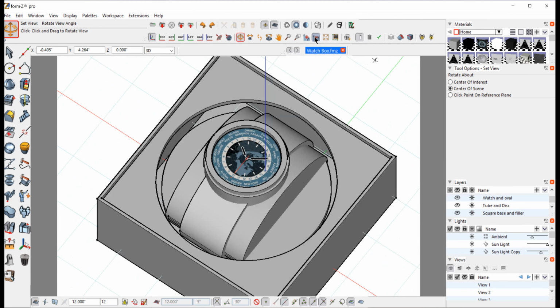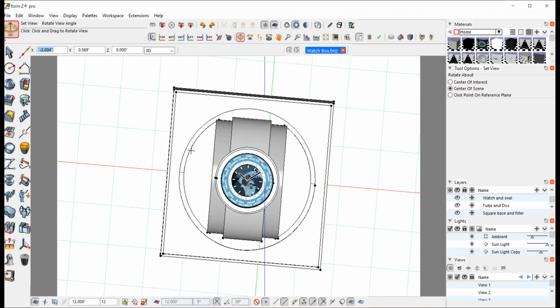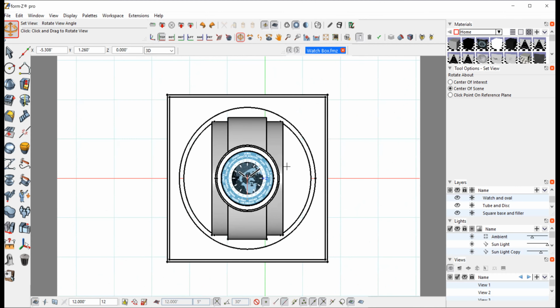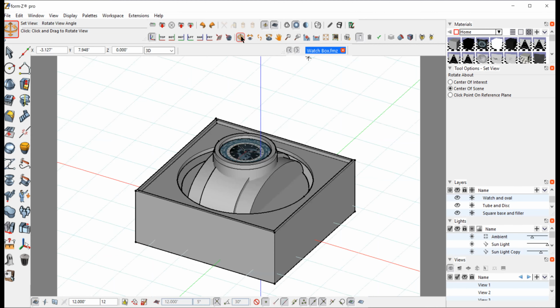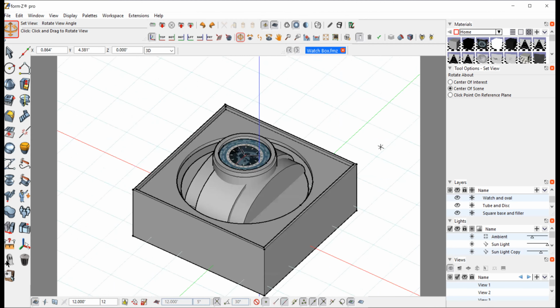This is the same process that we're going to use here for this workflow. So I knew from my sketch I wanted the proportions of this box to be square. So I just decided to make a square shape, this proportion, which gives me enough clearance around the parts so I can have that circle in there. I'm going to build a filler in here that's going to support that. And I can look at my dimensions. So, a little over 4 inches by 4 inches, which is a nice size. It's pretty compact. That's actually part of the stipulations of this project. I'm making this up just for our class, but it is based on a real project that I was working on. So let's unghost the tube.